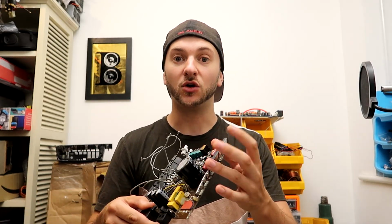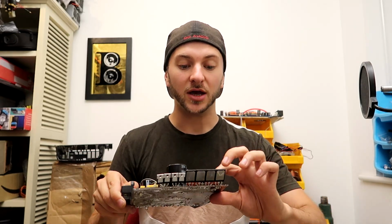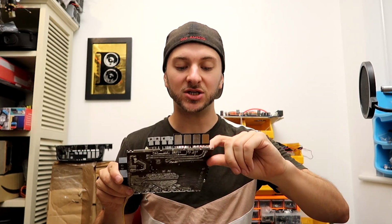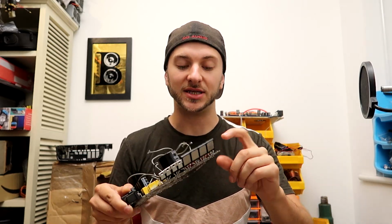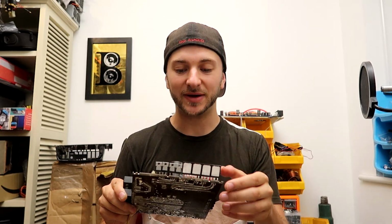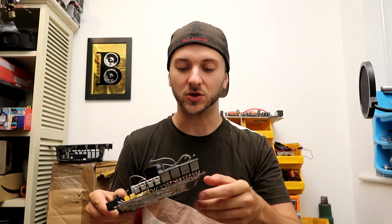Additionally, I might be running into issues where, even though we've only got 4 FETs on the output section and we've got one chip per bank, so we've only got one MOSFET on each of the outputs of the drive IC, perhaps they're just a little bit too hard to drive. Or we need to make some changes to the actual drive, the gate resistor or part of the diodes in the output section, so that the MOSFETs aren't quite as hard on the chip when turning on. We need to make some changes there, potentially to the feedback circuit or the final drive circuit.